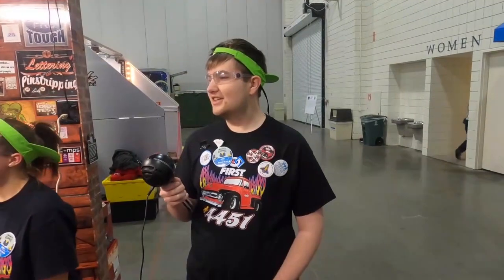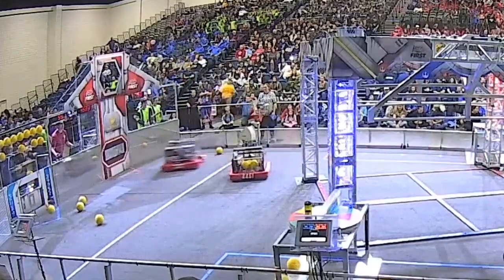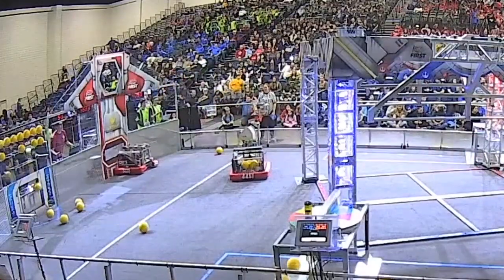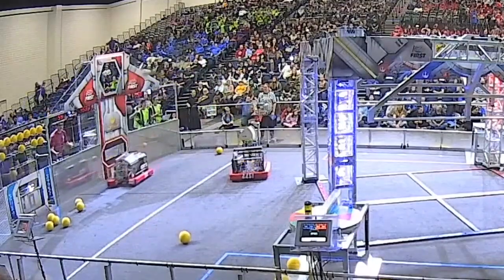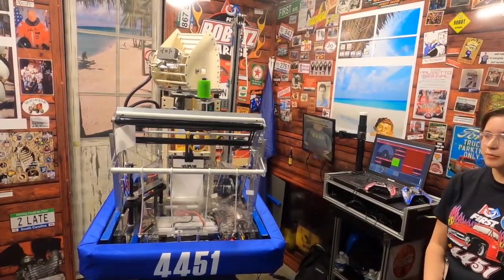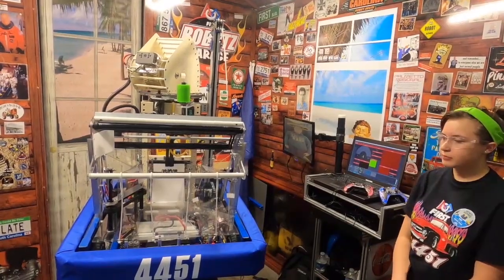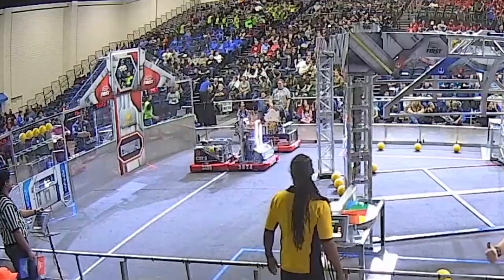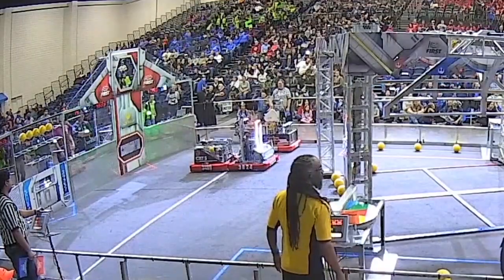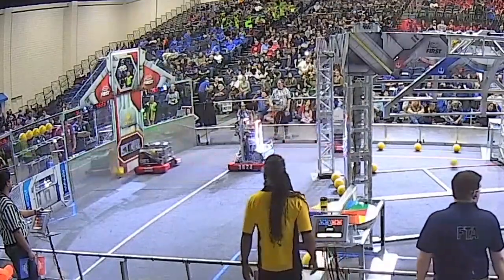This allows us to play well against defense this year, because we have four Falcon 500s in our drive base as well as six-inch pneumatic tires, so we really wanted to play around defense. The turret being able to rotate 180 degrees forward to back and use the Limelight to automatically track really allows us to play against anyone who wants to push us around. We have different pipelines — one short pipeline from around the front end of the field, and one long pipeline for long shooting. We can shoot from the 10-foot initiation line, the trench, and from behind the color wheel if we need to.